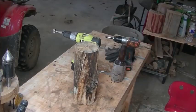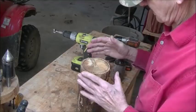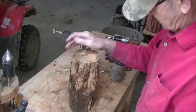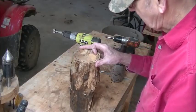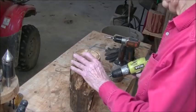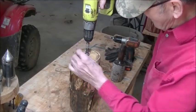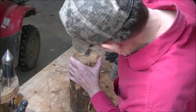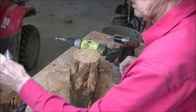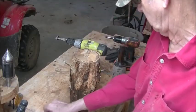I'm going to turn this between centers. The biggest end is going to be the top of the stand, and the smaller will be the base. This looks like it could be pretty — it's got quite a bit of spalting in it. What I always do is take the one end with the drive center and use a one-inch Forstner bit and drill a hole about halfway in. What that does is capture the piece in there so that if something happens, it's not going to fly out on you.